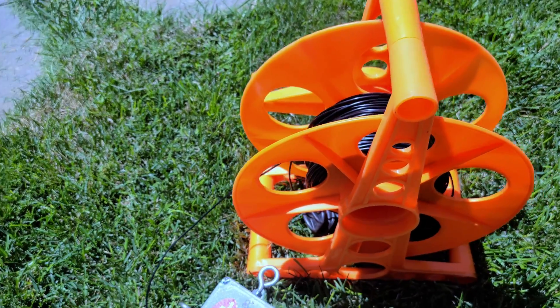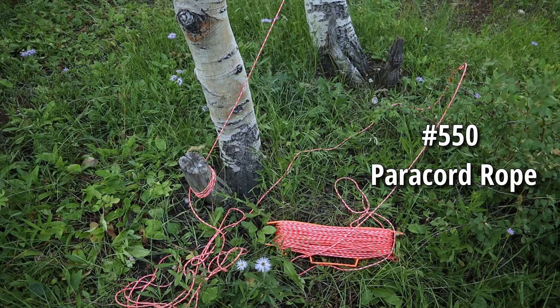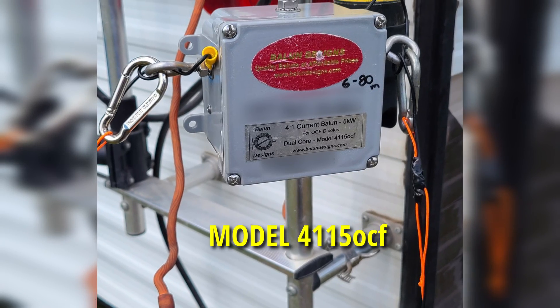Here's what I'm using. I took a 500 foot roll of wire that I had at home — some 18 gauge wire — and pulled that off to 288 feet. That's about what it was when you measure on an antenna calculator for 3.5 megahertz, and the rest of the harmonics fall into place. I've also brought four 100 foot lengths for getting the antenna up in the trees. I'm going to feed it into a four-to-one current balun, feeding that with some RG-8X. Because it's rainy and stormy, I'm going to tape that up with electrical tape to temporarily keep water out. I got the balun from Balun Designs — I used it for an off-center-fed dipole a few years back.